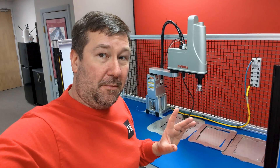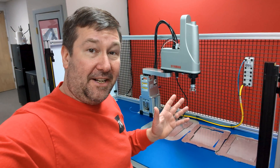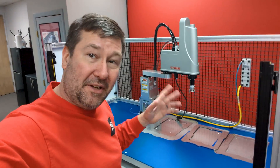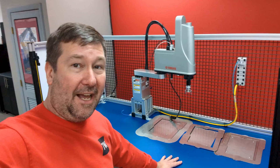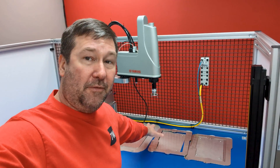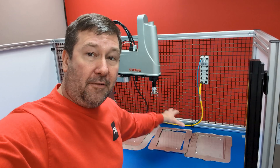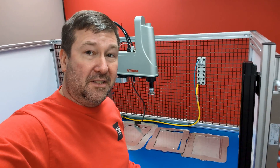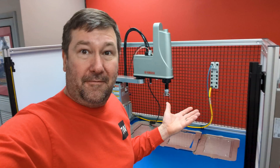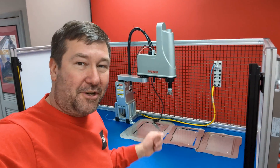I didn't want it fully finished because I wanted to see what ideas you came up with, and also many of you are doing upgrades. So immediately after we're done with this part, we're going to be looking at adding a pick-and-place system over here to pick the frames up and move them through. We'll be looking for a linear actuator and probably some type of pneumatic vacuum gripper — not even sure exactly what that is yet.